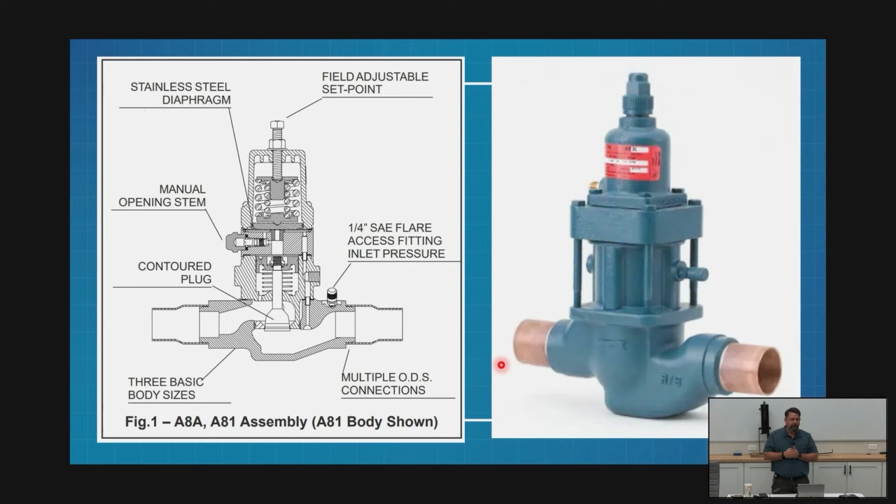So I'm going to use my solenoid to override it. I'm going to make my solenoid override its ability to regulate. I'm going to run all summer long like that. In fact, my program is not even going to turn on the solenoid to let it begin to try to regulate until after my last fan shuts off, where my VFD hits 0%. Yes, sir.